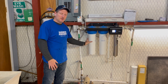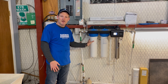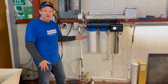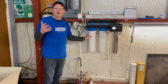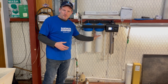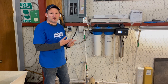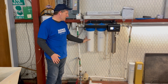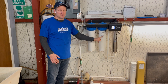The first housing has a sediment cartridge inside — a 4.5 by 20 inch sediment cartridge. How often cartridges need to be changed is difficult to say because it depends on how clean or dirty your water is. The second cartridge is a carbon filter, which tends to restrict flow more than the sediment filter. When you notice a drop in pressure on the discharge side of your filtration system, the carbon filter is typically the culprit that needs to be changed.